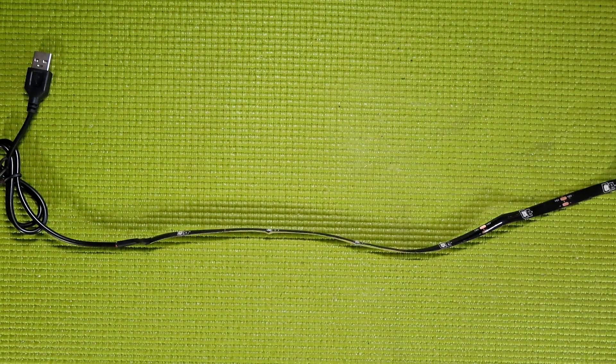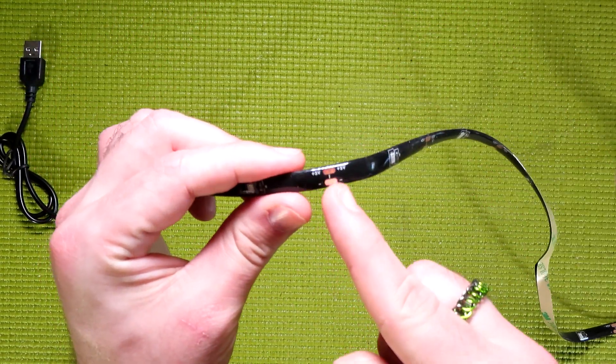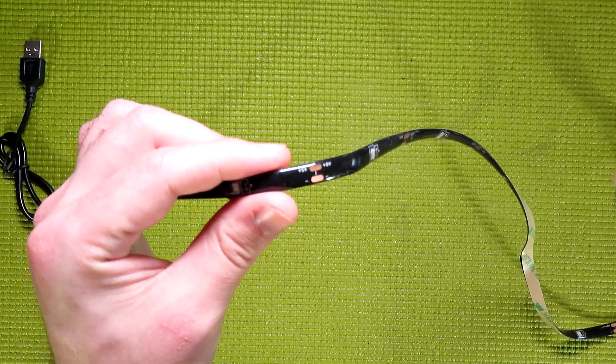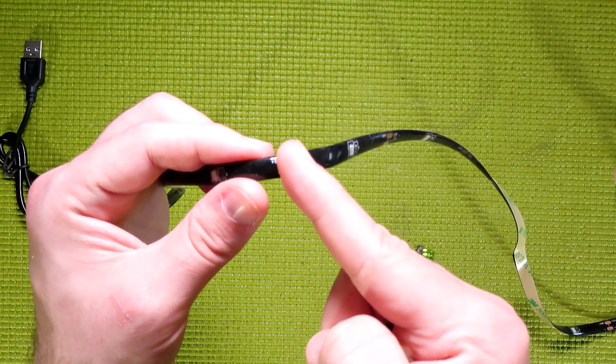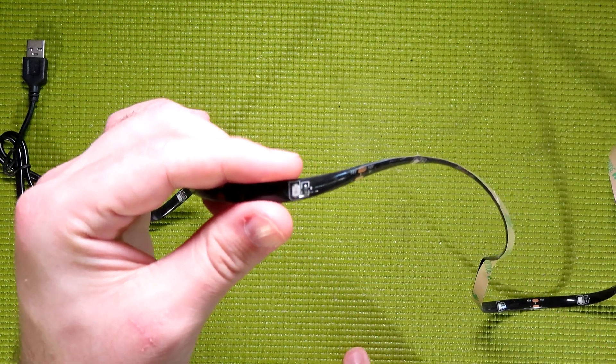Before I demonstrate these LEDs, let's talk about a couple of the things mentioned on the box. The first one I want to hit on is the fact that these LEDs can be cut to size. I always get comments from people talking about how they cut the LED strip and then it stopped working. The thing you need to look for when cutting these LEDs is this spot right here, where you see the two copper pads — or in the case of some more complex LED strips, four copper pads. You're going to be cutting right here across the line between them. If you cut somewhere else, you're going to have a bad time.